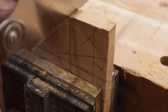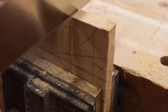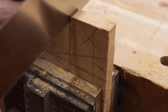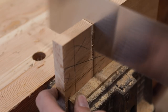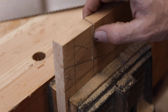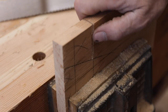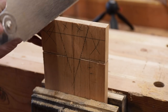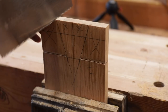See how clean and nice that is — no tear out. This is where it's so important to have a good saw. See how that's laid right in the kerf alongside that knife wall — now we can carefully follow that knife wall. The saw is going to almost naturally lay right in that portion we've cut. Now if you do get a little tear out from not being careful with the saw, that's okay — it will sand and we'll put a little bevel on that. Wood's pretty forgiving. Now we can cut the angles freehand — start gently but cut close to the line because we don't have room to plane that.